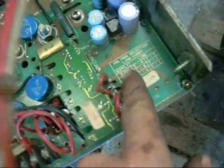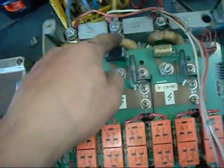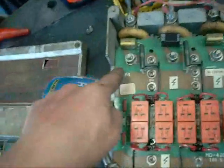It's got multi-voltage selection — I've just changed it to 220V. I'm going to try and run it on single phase, not three. What's got me confused is that there are three phases going in — 1, 2, and 3 — I presume with current transformers there, but you've only got two outputs: A2 and A1.